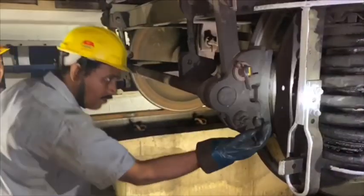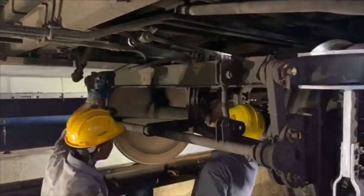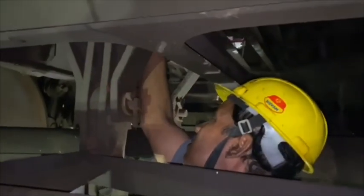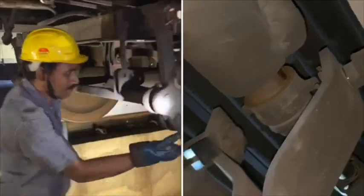Piston stroke length can be adjusted with a piston stroke gauge in brake applied condition, and check for slackness at brake block in brake release condition. GS and SLS coaches will be provided with a piston stroke length of 38-40 mm, taking into consideration overloading to avoid brake binding.